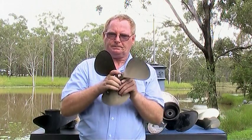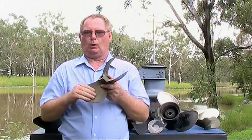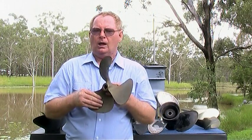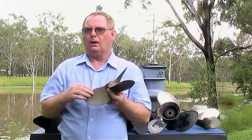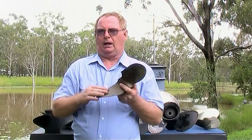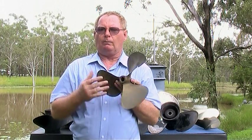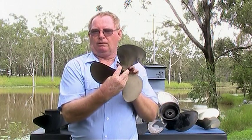Speaking of inboards, I had a really interesting chap come in one day. He had just travelled 600 kilometres by water in his new displacement boat with the propeller vibrating all the way. It was a larger bronze propeller which he had picked up at a scrap metal shop before he left and put on his boat. It was a pretty flat clover-leaf propeller which had a tapered shaft bored through the centre of it. The only problem was the taper for the shaft was bored the wrong way, which explained the vibration.